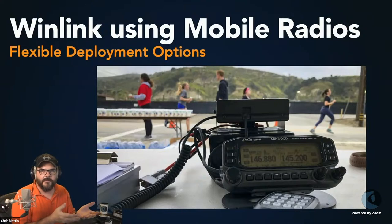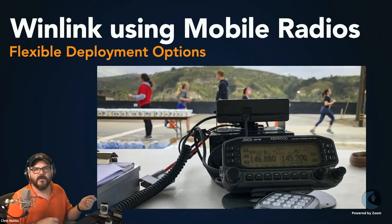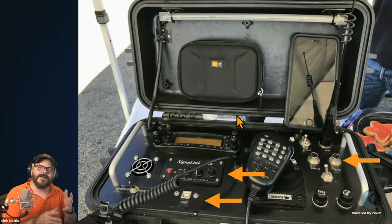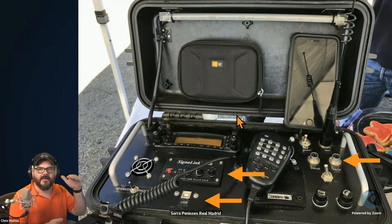As I became more experienced and got a Kenwood D710G as a mobile rig, I'd set it up at different events in a similar format — just a little stack. I was using WinLink with the built-in TNC, a simple cable coming off to my laptop to send WinLink traffic. Then I saw this go-box, very nicely designed — a small vertical Pelican case with the mobile radio mounted in the surface. It had a SignaLink with a USB port drawn out to the outside, the data connection port split off from the radio, and a little switch for voice or data.